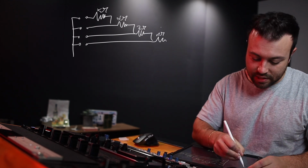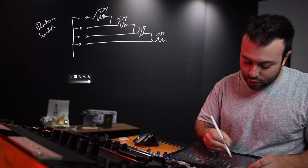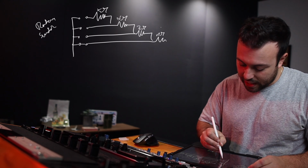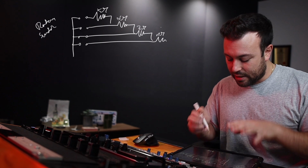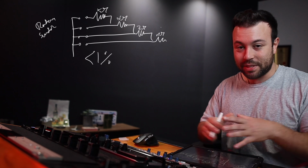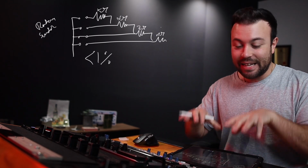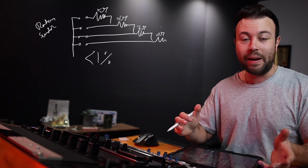And what happens is, this is our rotary switch here. We turn the knob and we get this connection here. It switches into this position and we have N ohms of resistance. Then we turn it again and we go to a new fixed point. And the beauty of this is the tolerance is about 1% or less. Okay, it's under 1% of tolerance between your left and right channel, which means recalling is super easy. So this is one of the things I look for in mastering grade units, simply because the tracking between your left and right channel is super important.